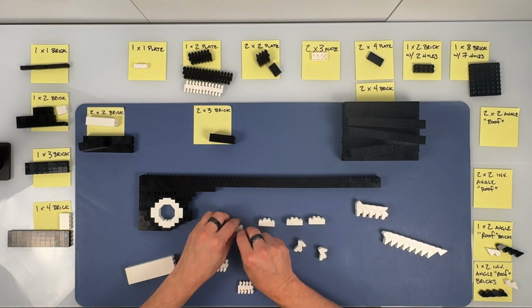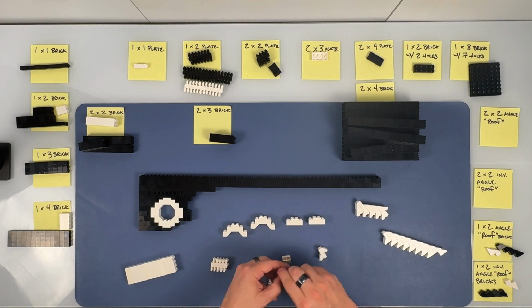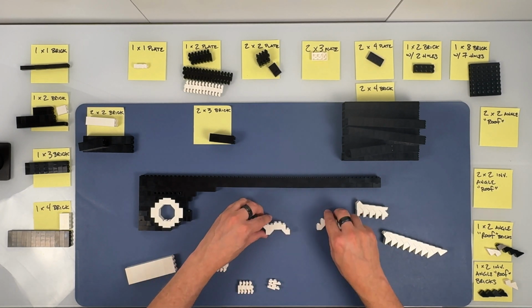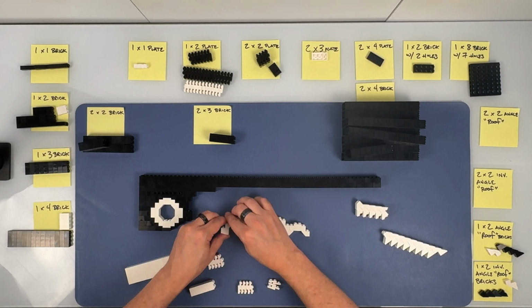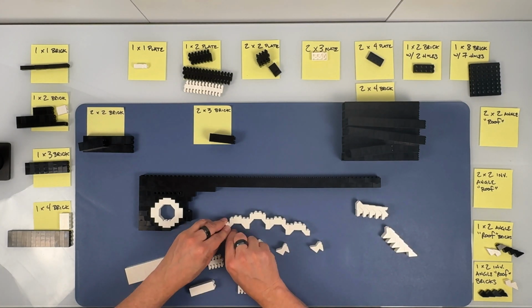So you would drill through the wooden backboard through those holes to create your guide holes, and then ultimately when you're connecting it, you just drive a screw through it. You're not wrecking any of the bricks because you're just going through the open holes, like two top, two bottom, and anchoring that to the board behind it.